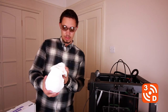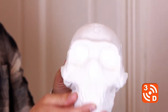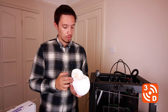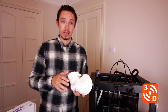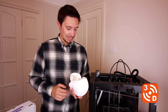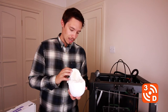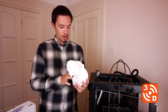I'll do a proper clean up later but that has come out really nice. You may notice on the bottom there are a few places where the PLA didn't properly adhere to the support material and has been knocked away before the rest of the skull was printed. It's only a few small places and something that could easily be fixed in my cleanup process. I'd imagine that's something I can overcome with my settings rather than it being an issue with the support material itself. Other than that, most of the areas it's come in contact with have adhered really nicely and given me a nice clean finish, so I'm really happy with how it's come out.